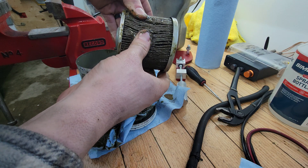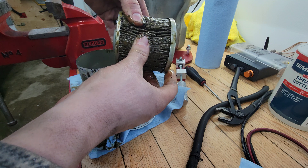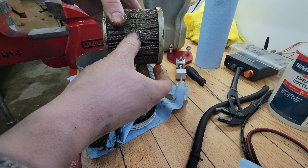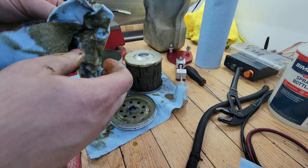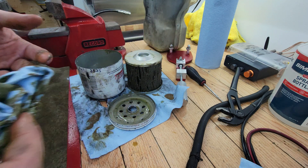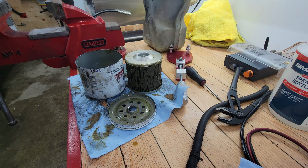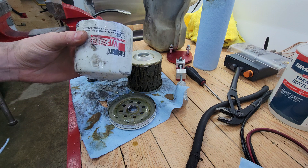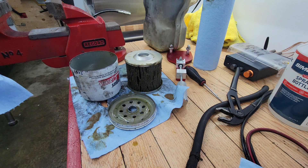I'm not sure how much filtering this was doing once it got clogged up like this, but I might need to shorten my interval until it cleans right up, or do a better job at flushing the system. You can see it's a pretty significant amount of crud in the cooling system. In my opinion, definitely worth having a coolant filter. This coolant filter doesn't have any additives — it's just a WF2070, it's just a filter.